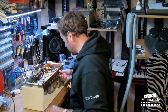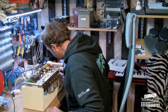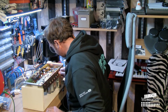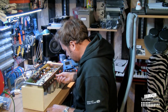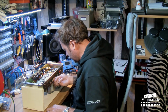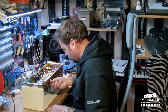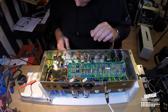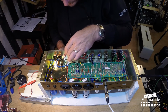But let's listen to the potentiometer, so the presence is still not good. And it's also not quite fixed in the chassis. Nothing in the bass. The middle control seems to be quiet now. And so does the treble. I'm just going to make sure that I fix this potentiometer, because it's not quite tightly mounted.